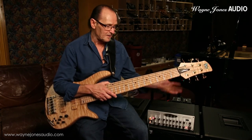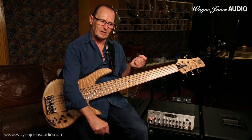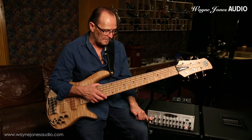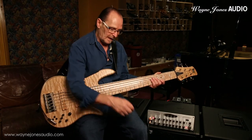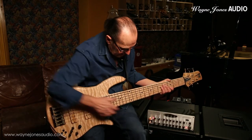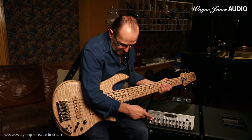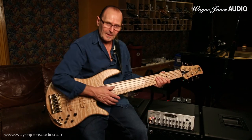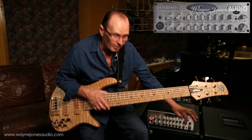Andre is over the moon about it — he takes it into sessions and uses it, same as Marcus. Scott Colley wanted to phantom power his mic on the upright so he could blend the microphone with the bridge pickup, so I added phantom power. The gain on channel two is set for a microphone, so if you're using two electric basses you might need to increase the gain on channel two to equal channel one.